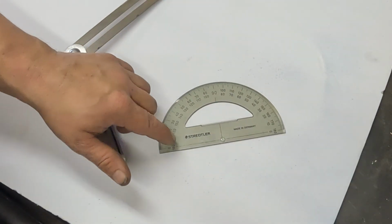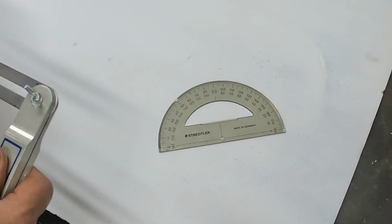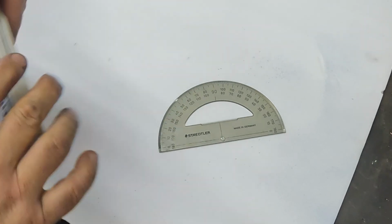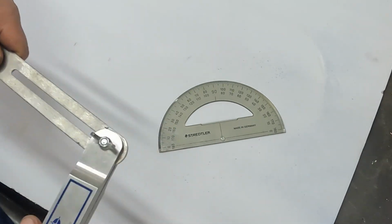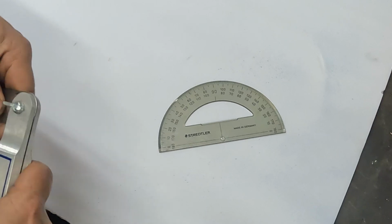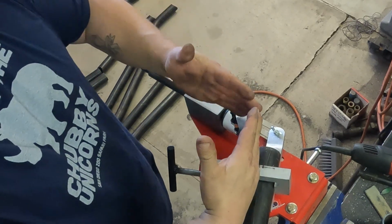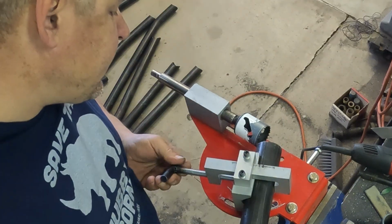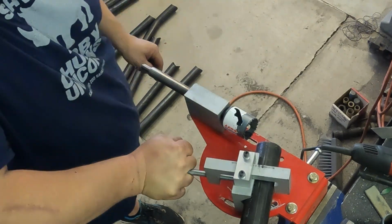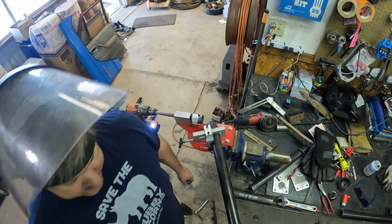If you want to cut a 15-degree notch or bevel on a tube or a 2x4 or, you know, your arm or whatever you decide you're going to cut, but you can't cut a 15-degree angle with the tool that you're using, you have to cut a much sharper angle than that. So there's a little bit of math. If you subtract 15 degrees from 90 degrees, you get 75. Now that this is locked in place at 75 degrees, all I gotta do is line up this hole saw, and we'll cut a 15-degree bevel out of this end. All right, let's put it in the truck.